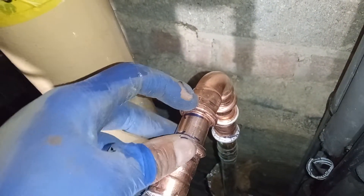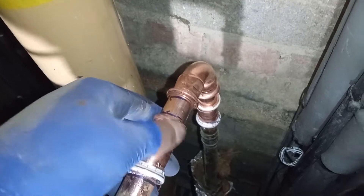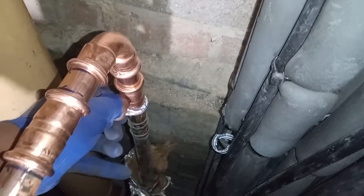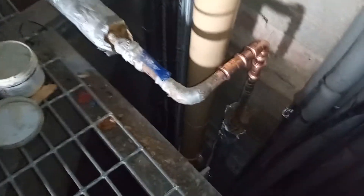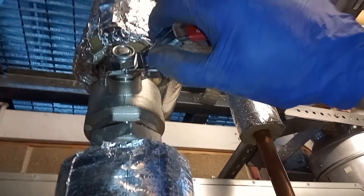Pressing these joints. It's good to put a mark on them to ensure the fittings are fully in. Ensure that you use the clean material provided — the deburring tool and emery cloth if need be — to wipe down the joint before doing it, and double check afterwards that all have been pressed. Also before press fitting and before cutting pipes in, ensure your press gun can get into the sections, make sure your batteries are fully charged, and do a little recce first to make sure the gun will fit in the spaces.